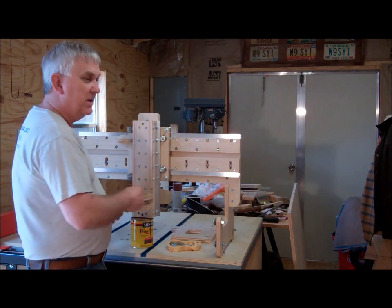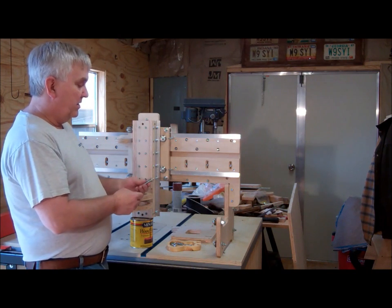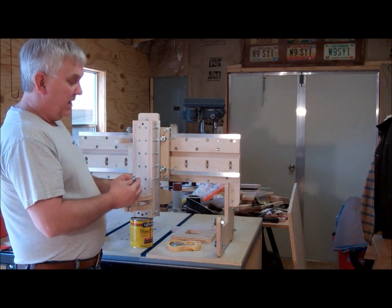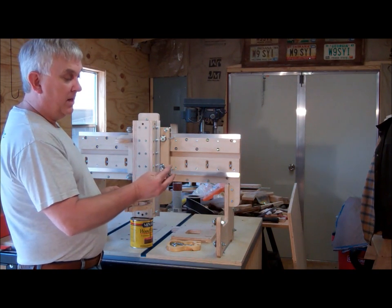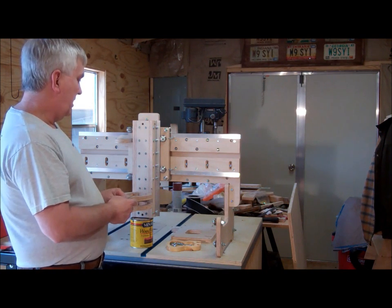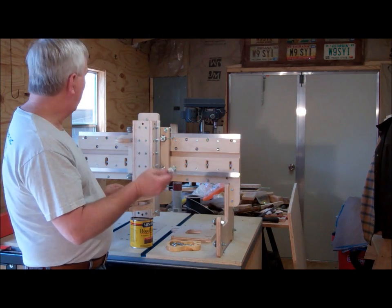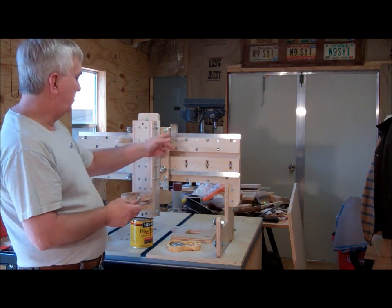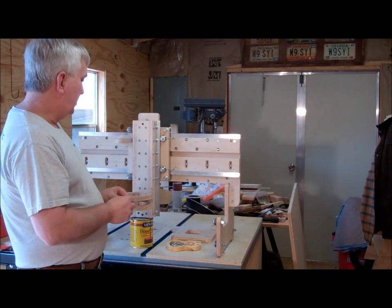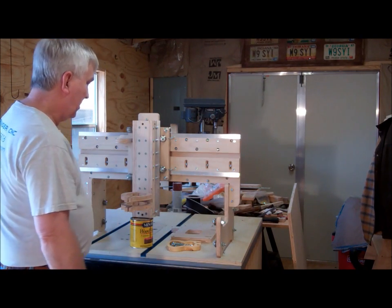Another mistake — when I ordered these big screws from McMaster-Carr, these are 3/8-16 and I got some 2-inch and some 3-inch ones. I must have clicked on the wrong option and got ones with a slotted head instead of a Phillips head. Do not — I repeat, do not — use the ones with the slotted head, because they're a pain to drive in with a cordless drill. It's a whole lot easier if you have a Phillips head. But since I've got these, I'm going to go ahead and use them.